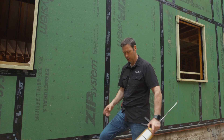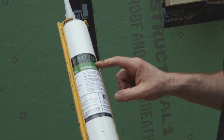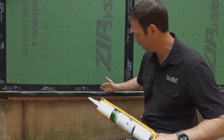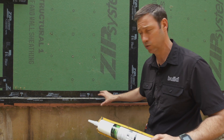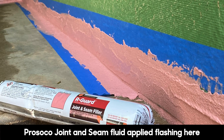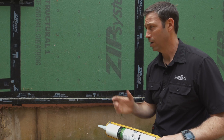You've seen on a lot of my videos using liquid flash or other fluid-applied flashing products to connect the sheathing to the foundation — that's a great detail. This house is a little different because I've got foam going on it. I put a two-by-two on the bottom to receive the foam on the outside — two inches thick of foam — and I taped that so water running down the face of the wall will run out. Behind that I've got a fluid-applied flashing as well to air-seal and bug-seal that joint. But from there on up, you can see all I've got is the tape.